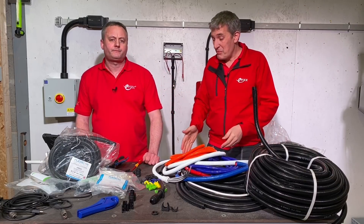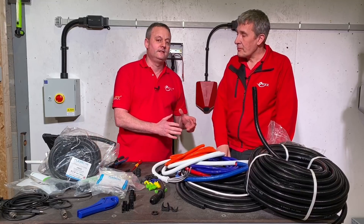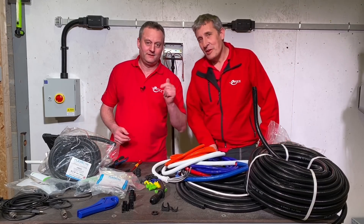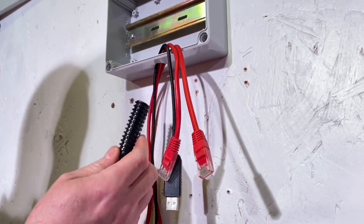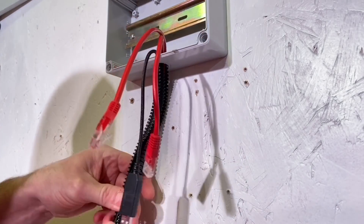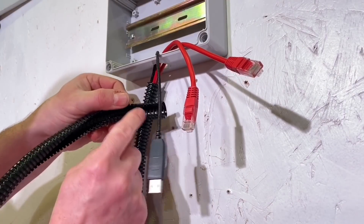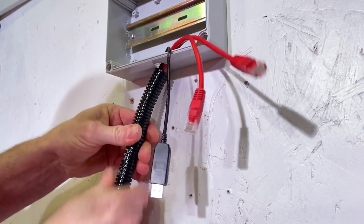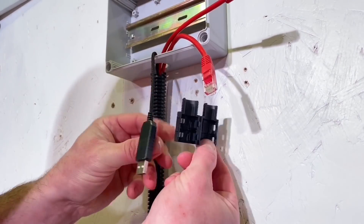That's probably one of the easiest applications for this - when you need to revisit an existing installation. A lot of the time you have to install pre-manufactured leads, and we've got some RJ45s and a USB here. So I've taken the divisible slit conduit - the slightly smaller inner version going round - and then the one with the wider gap just wraps round it, marries the two together. It just clicks into place. That's a great application because there's no way you'd be able to thread those cables through a standard flexible conduit and get them through the gland.